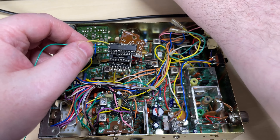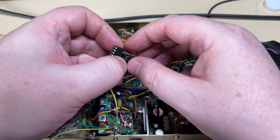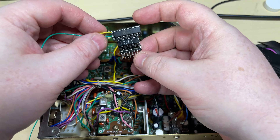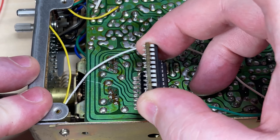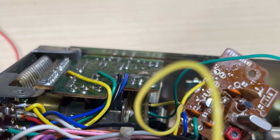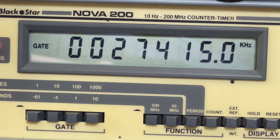What we're going to do is fit one of my modification boards into it, with the UK40 off the high band. Notice how I say high band, because something goes wrong with this radio very soon. We'll just offer it up to the back, make sure the holes are nice and free. I'll just jump in the wires from high — drops us onto UK40 with no offset. Offset's not a problem, we can fix that.